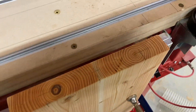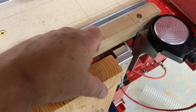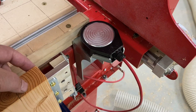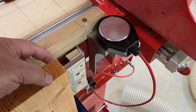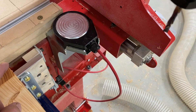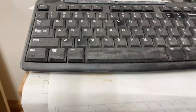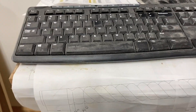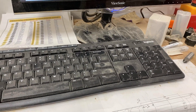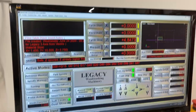Now to get the vise — this is X0 and this is Y0. I took the bit, miked it, brushed it on the edge, just touched it, then added half of the width of the bit in. I did the same on the Y spot — half. I recorded those numbers, put 0 on that X and Y spot. Once I was on them, I zeroed it and ran the gantry all the way back up to the stops. That number was what I wrote down.